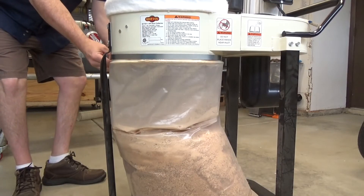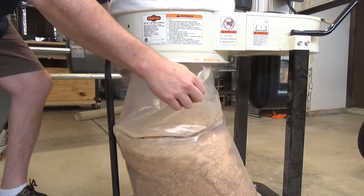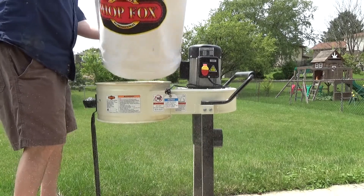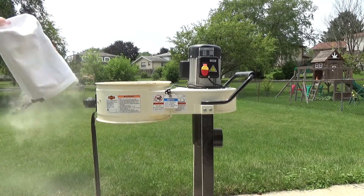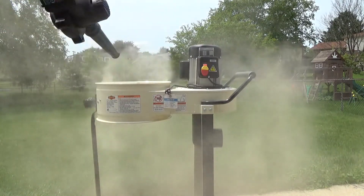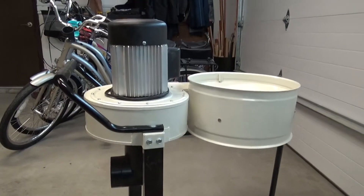To find out more, I'd like to do the so-called free fan test. Since my dust collection bag is full anyway, I go ahead and take off the lower bag, take the unit out into the backyard, strip off the filter bag, and blow everything out. I do a fairly thorough job of cleaning out the upper filter bag, but I don't take it all the way to totally clean.